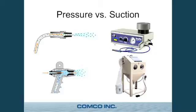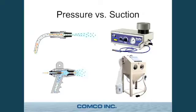The main difference between a microblaster and a traditional blaster is how it mixes the air and abrasive. In a traditional cabinet blaster, you have an air line coming in through the back of the handpiece and a siphon tube going down into a drum of abrasive — that doesn't feed abrasive particularly consistently. In a pressure pot system, of which microblasting is a subset, the mixture of air and abrasive is made at pressure. What really separates a microblaster is that we separately feed abrasive into the air stream, decoupled as much as possible, so you get a very accurate, repeatable abrasive stream.